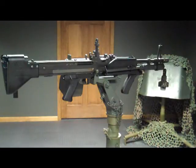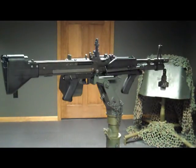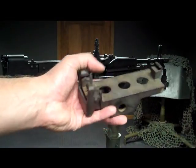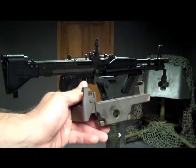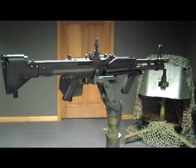I have the gun mounted in my cradle mount. This is because we are going to be banging on the side of this rear sight to slide it out of the top of the trunnion, and it is good to have it secure so the gun can't move. If you don't have a cradle mount, I would recommend picking up one of these platform mounts. You can mount the gun in it, put it in a vise, and it holds it very secure. They are cheap — if any of you are interested, just leave a message in the comments and I can direct you to the right place.